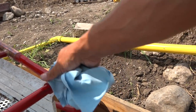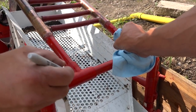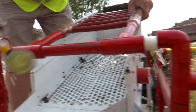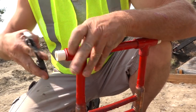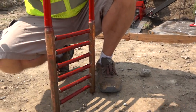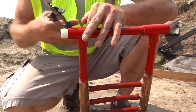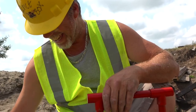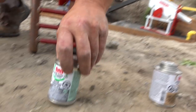So what we're going to do is, since it's painted, we're going to bring it up to the level that we want, right about there, and draw a line on either side so we know where it lines up when we're gluing it. For anyone who hasn't put together PVC piping before — two parts, basically a primer and then the cement. We're using a clear cement today and a small bottle. You want to make sure you have a small brush and applicator, because this stuff can go everywhere. If you get any of the purple primer on your fingers, good luck — you're going to look like you have robbed a bank for the next week.